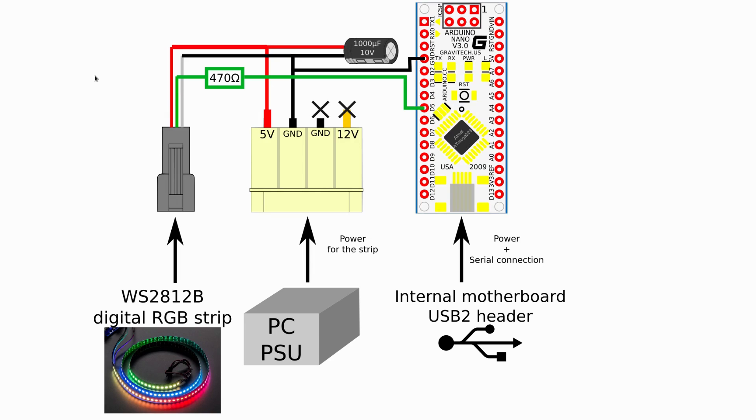Let me show you how I actually made this thing. This is the electronics that make it work, and this is an SVG — you'll probably find it in the description so you can have a better reference if you want to do this yourself. This is fairly simple even if it doesn't look like it. The core — the brain of this thing — is basically the Arduino Nano, which controls the LED strip through the data pin. This green line you see here is the data wire that tells the microchips inside the LED strip what to do. In my particular case, I have the data pin on pin D5 of the Arduino Nano.